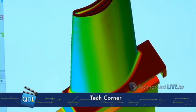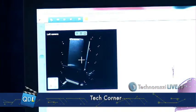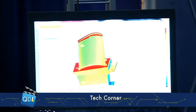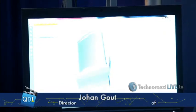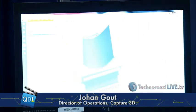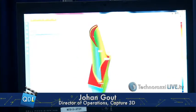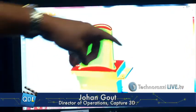What we've got here is, believe it or not, just eight scans on a rotation table. After this next shot you can see the amount of data we have on the system, and then we'll bring up the full measurement. This is actually the three-dimensional scan data — it's not a CAD model — and if you rotate, you can see the fidelity of the data. This would be another example of the color map comparison. I've laid the CAD model — my design intent — with the scan data on top of it. Where it goes from yellow to red, I'm outboard to CAD, and where it goes blue to dark blue, I'm inboard.